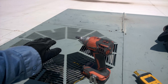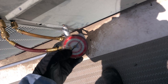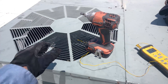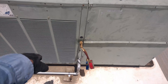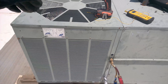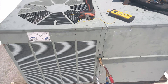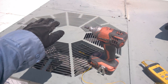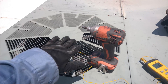That works a little better with the air blowing up instead of pulling down. It was 320, now it's like 285. The discharge air is 116, where it was 130 when it was pushing down — because of the fan blades' pitch and just fighting gravity, trying to push that hot air down with the backwards pitched blade just isn't going to move air efficiently. That's why there was a greater heat rise across the coil coming out.